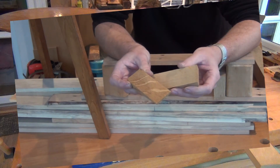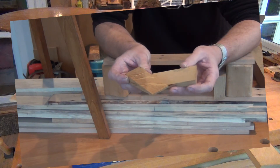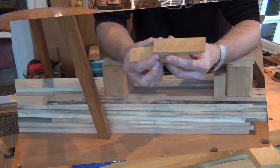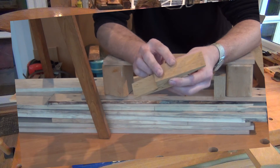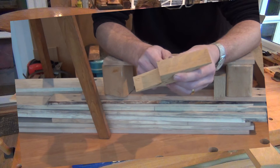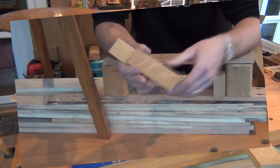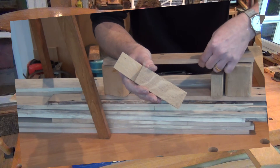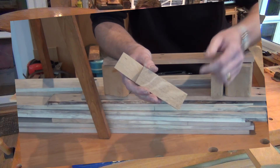It really is as simple as that. And it causes less destruction than other methods because when you're pushing the wedges together, the force that's applied is even right across both sides of the slat. Whereas if you use a wrecking bar and you lever, then you're pushing up hard on one side of the slat and not the other — and that's when you tend to get slats breaking.